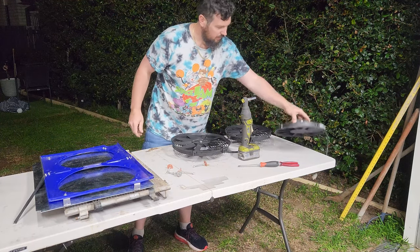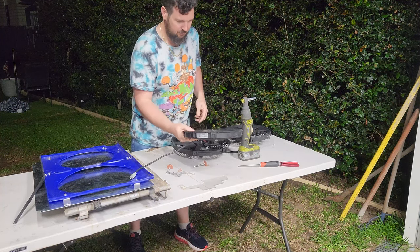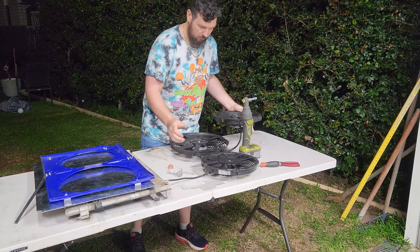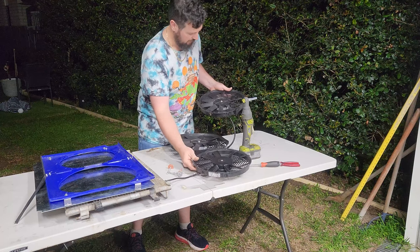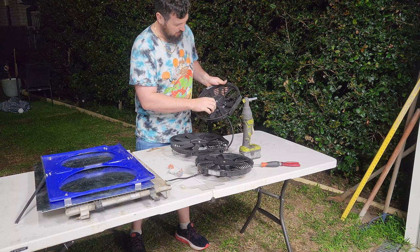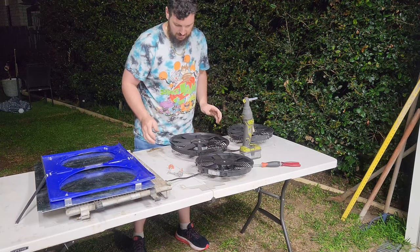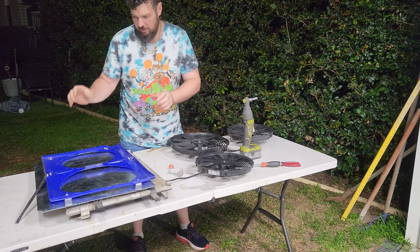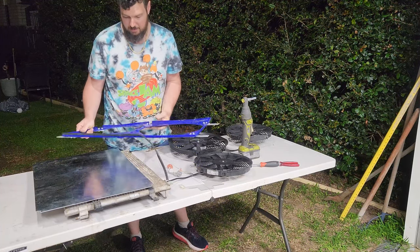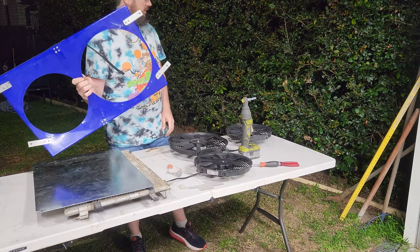The other reason is this is a puller fan, which is designed to pull. We had this on the front mount cooler on the old one. It's lighter and does a better job than the push version running in reverse. So we're going to put this one on here, and with a metal version it ain't gonna bend, it ain't gonna warp, and it will do a better job.